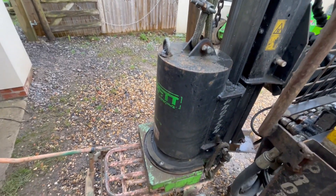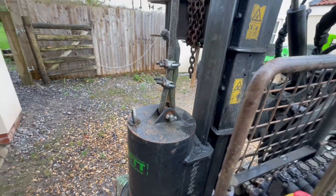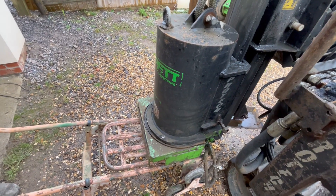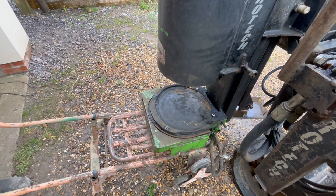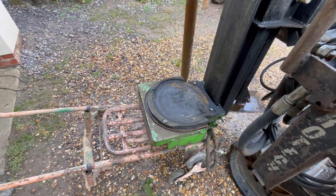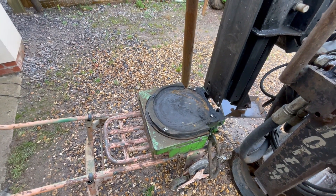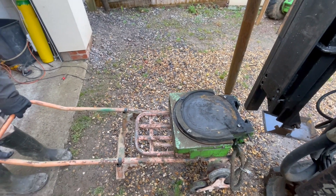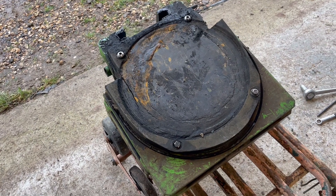We move the rock spike out of the way and slowly drop the plate down so the weight is taken by the trolley. Now we're going to lift the telemast so you can lift the mast up through the plate — the mast lifts the weight so we can see what's going on. That's a really safe way with no one underneath the weight, and Dad can now pull the trolley out from underneath. The plate is now off.